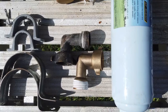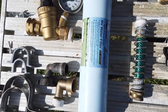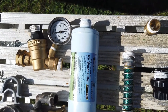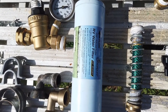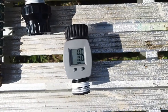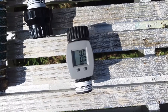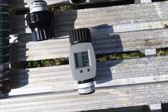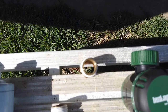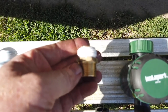I also want to make sure I have a couple of elbows. I want to hook in a water filter, and I want to do it inexpensively - I don't want to buy a two or three hundred dollar water filter. This little inline filter is just perfect. I also have a backflow preventer and a digital gauge that tells me how many gallons have gone through - especially useful if I want to fill up my fresh tank so I know exactly how many gallons are going in. And I also have a sprinkler timer.